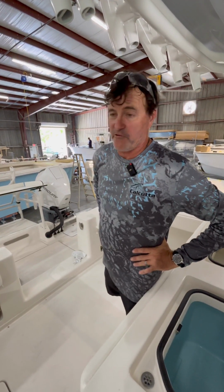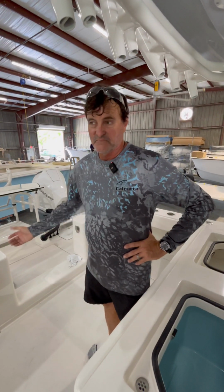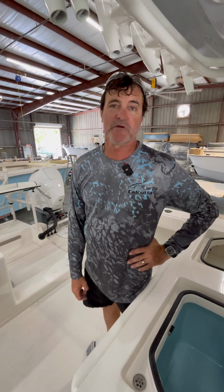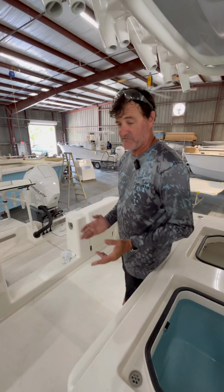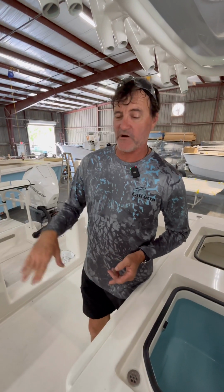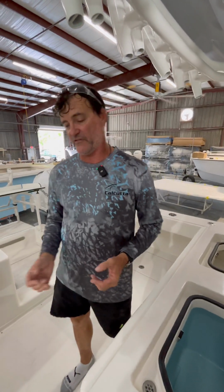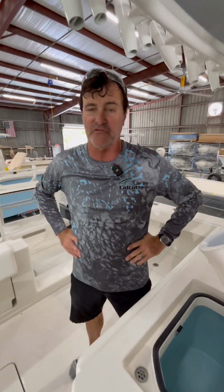Under the boat, same with the trailer, pressure washers work great. Clean your trailer, clean the bottom of your boat. Typically, if it doesn't sit in the water for a long time, you really don't have any issues with the bottom of your boat. Quick blast and get off of it. Maybe a little scrub. Part of your stainless hardware, you start seeing a little bit of rust on your stainless hardware. They make metal waxes that will stop that. Occasionally you can go out there and put metal wax around from your through holes to your rod holders and some other things, and it just keeps them nice and shiny and doesn't let the salt corrode into them and start etching into them and cause surface rust that you see in a lot of stainless hardware.